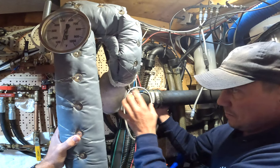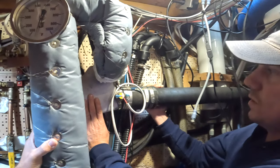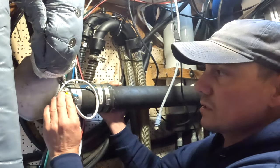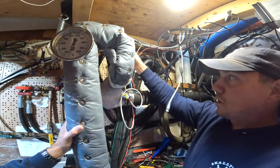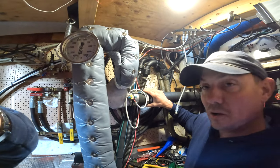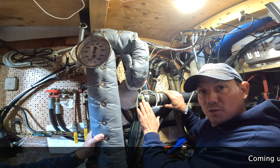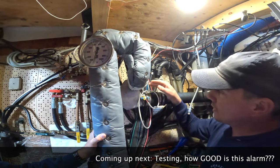The important part about this band clamp on our exhaust temperature alarm is that you have this on the metal. If you have this on your rubber exhaust hose, it's not installed properly and it's not going to function. It's not going to protect your engine as it should. Make sure you have this clamp on your exhaust mixing elbow. Because if you lose cooling water here, what's going to happen is this 500 to 800 degree exhaust air is going to melt your hose in about 20 seconds. Then your boat's filling up with potentially seawater and definitely exhaust from your diesel engine. So this will save you so much heartache for the 80 bucks that it costs. Look at this DIYers — two wires, a band clamp.